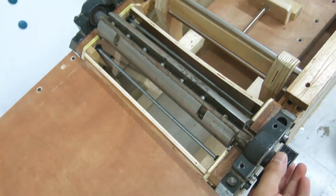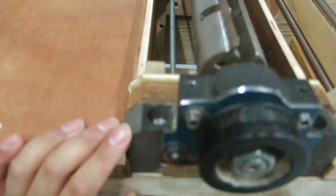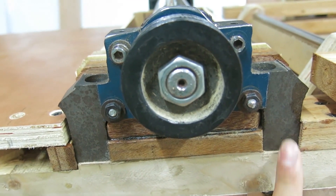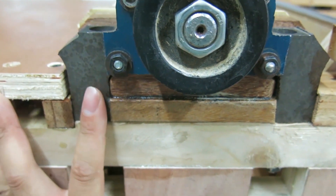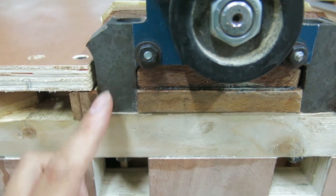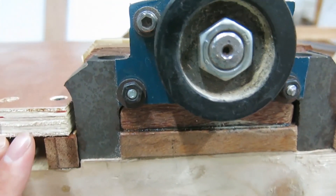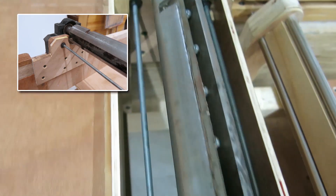Let's take a look at the installation of the bearing seats. The bearing seats are cast iron. I cut the useless corners. There is a block placed between the two feet so the bearing seats can be moved right and left. The foot has an M8 thread hole on both sides of the bottom. I screwed a short threaded rod into there through the hole on the wooden frame, then locked it with a nut. There are two bolts behind and up against the bearing block to help increase stability.